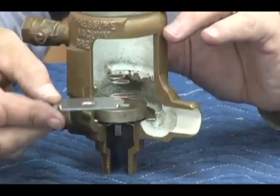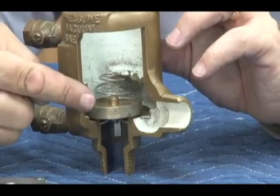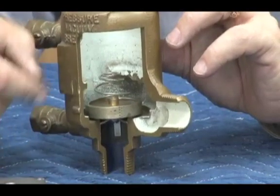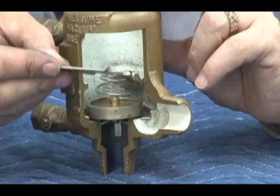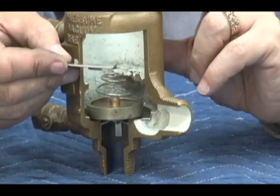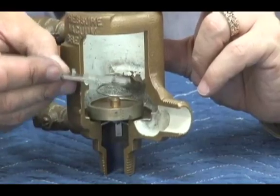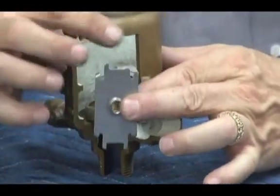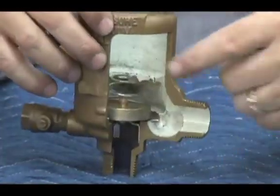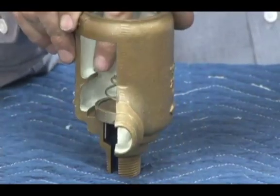Now the purpose of the spring retainer is to push perfectly flat down on that spring. Notice that it's a cone-shaped, not a cylindrical compression spring. So we know cone-shaped springs have a tendency to fatigue a little faster than compression springs. So how this spring retainer pushes down on it is very critical, because it has to be pushing down perfectly straight. As I said earlier, there's 4 little knobs on each corner of that spring retainer, and they have to sit underneath this lip right here and right over here.